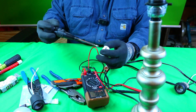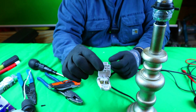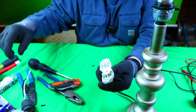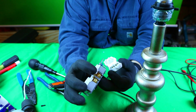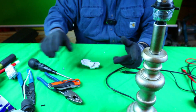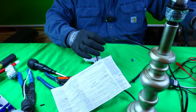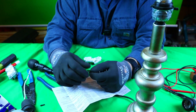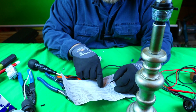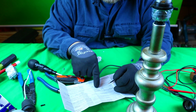When you open it up, you see you have a brass colored one, which is always your hot, and your neutral which is always your silver. Same goes for that on a receptacle — hot is brass, neutral is silver. Now, if you read the directions, which we should always do, it tells you that we need to strip three quarters of an inch off of our plug. It says ribbed conductor to silver screw, non-ribbed to brass screw. Round cord: white conductor to silver screw, black conductor to brass screw.